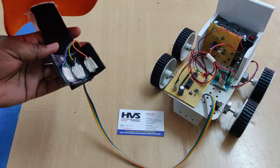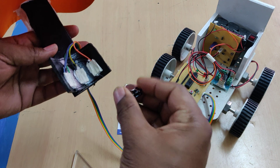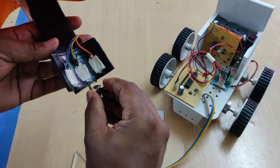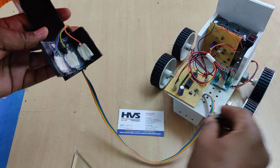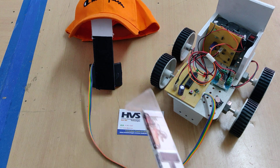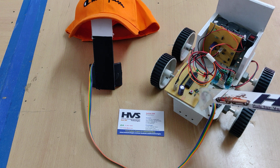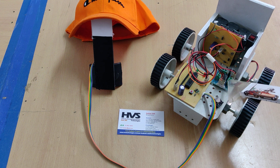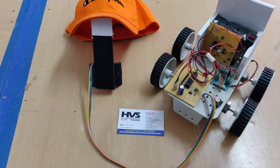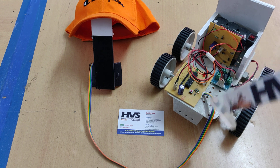We are using a PIC16F72 microcontroller. The Hall effect sensor will provide pulses whenever it interfaces with a magnetic field, so when we place this magnet near the sensor, that particular sensor will send a trigger input to the PIC microcontroller. We interface three Hall effect sensors to the PIC microcontroller at pins A0, A1, A2, and also an L293D motor driver to control the wheelchair movements, with two DC motors connected to the L293D at pins C0, C1, C2, C3.